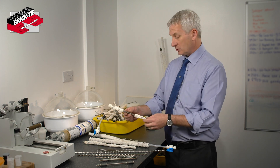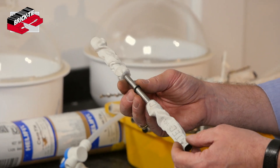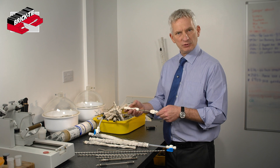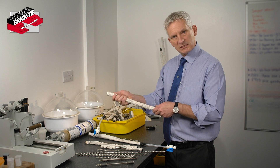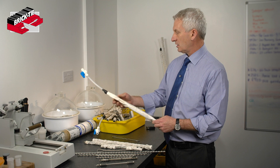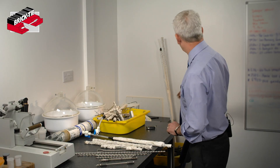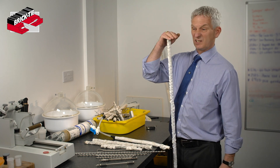There are more advanced types of ties. The sock anchors — we've been using these for well over 25 years. These are excellent in weak substrates, rubble-filled walls, any walls with voids or perforated masonry units, perforated bricks. They go right the way along to much chunkier, thicker ties where we've got bulges that need to be restrained. Here's a sock fix tie from Helifix — this is the valve that keeps the grout in place once it's been inflated. They can go all the way along to ties twice the length of this one.